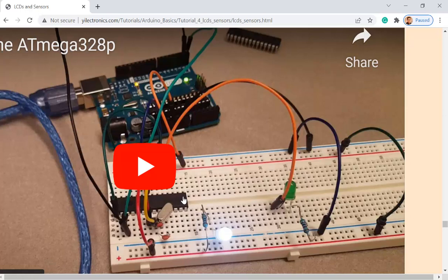So for example, I have a specific design for a company or somewhere, and I definitely don't want to use the whole Arduino board, right? It has all the unnecessary peripherals, the USB ports, and I just don't need them. I just need a chip on the PCB, okay? So I design a PCB, I have the chip over there, I have all the necessary components, like the oscillator, the caps, and that's it. I don't need the ports like this, and I don't need the USB serial converter, and I don't need all these headers.